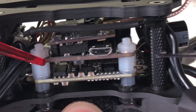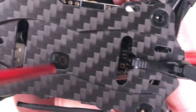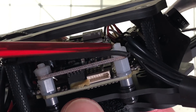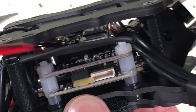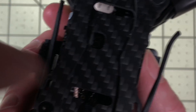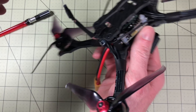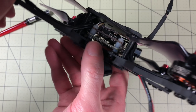So here's the stack. We've got a 4-in-1 ESC and the flight controller. On this side we have the VTX, which is really nicely designed so you can easily see what channel you're on — they cut a hole, and unlike some other vendors, they cut it in the exact right spot, so at a glance you know exactly what channel and band you are using. On the other side we have the XM Plus, which has been soldered directly to the board. There's a 3-pin header connector that this is just connected to directly, and then the antennas. These were weird at first — it took me a while to even find them. They were tucked way underneath. So I pulled them out just enough and turned them a little so they're not in danger of being caught by the props at all, and pretty much from whichever angle you're at, you can see one of the antennas. It ended up working out really well.